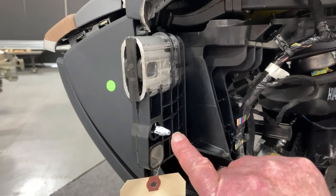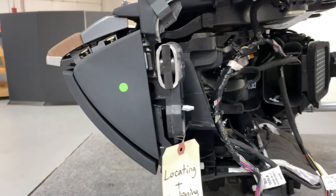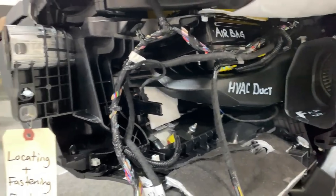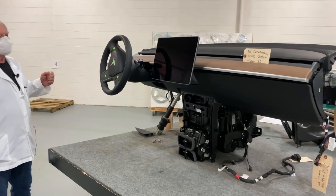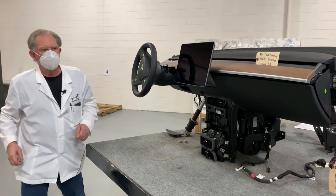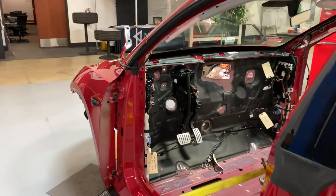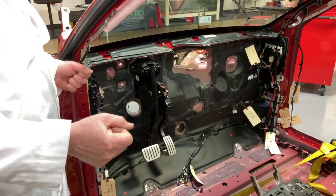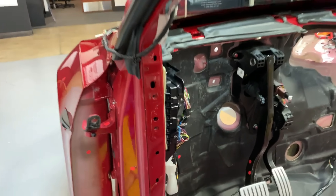I've painted a little location point here. Those location points have a corresponding hole inside the instrument panel. The instrument panel, when it comes into the car, is actually done by one person — usually on the driver's side. He's going to have a manual assist, which will be clamped to the IP, and that one person will bring it up. He'll pass it through the driver's side door, swing and turn it, and bring it around. The instrument panel will be flat to the floor, and as long as he can find the location point — which is relatively simple — he'll feel it clunk and it'll go in. Once it's inside, he'll fasten a few bolts to hold it in place.